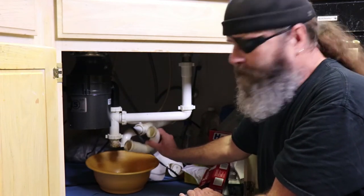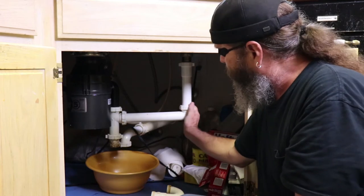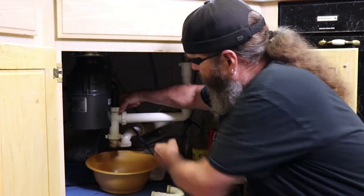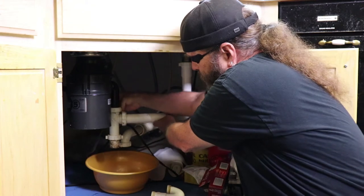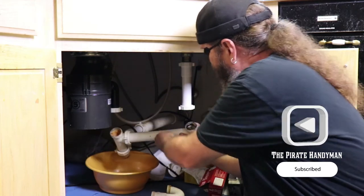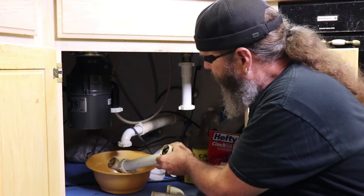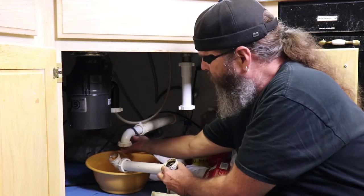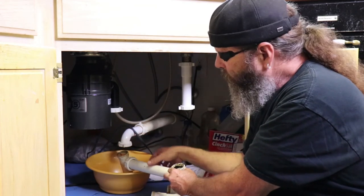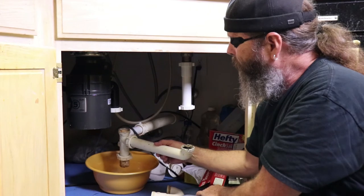Once we've done this, there are a couple other things I always like to do just as preventive maintenance. I'm going to take this loose over here from the right side sink, and then I'm also going to take it loose from the garbage disposal. I'm just going to look in there and see if I've got any stuff that's building up and clean that out. You want to see if you've got anything underneath here too. In that case, you want to take this loose, pull all of that out, and just clean it out. Give it a good cleaning. You can use the hose outside to spray in here and get it all cleaned out, and this will take care of your problem.